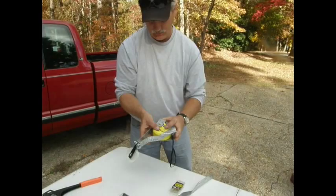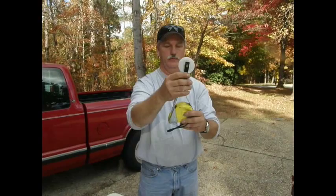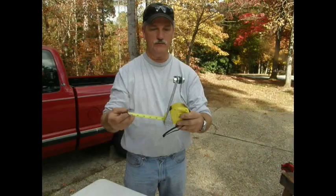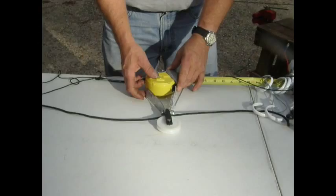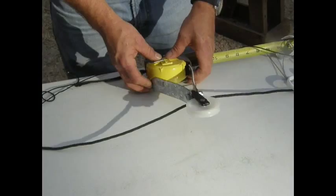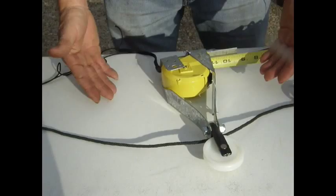Completed construction of our tape measure carriers — we created two. The final product has the pulley at the top, a bolt holding the pulley to the carrier we fabricated from rafter ties, with the rafter ties fastened together by rivets and a piece of aluminum at the bottom. That's our completed carrier — cheap, easy to build, no special tools required.